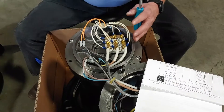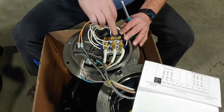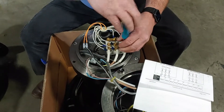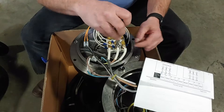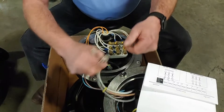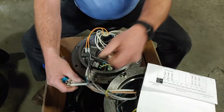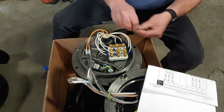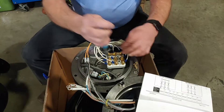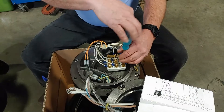At this time, we know we need to go to 460 on this pump, so that's what we're going to convert to right now. The first thing I'm going to do is remove the jumpers — that's an M10. The first thing I did is remove the power cables and move those out of my way for right now; we'll get back to those later. I'm going to take the screws off, set the nuts aside. I'm going to remove the other side because I've got to break those connections and get the strips off.